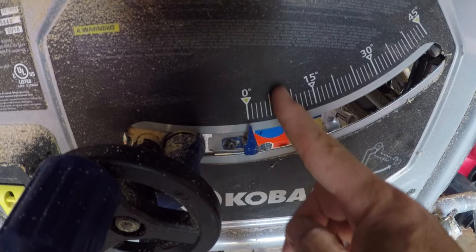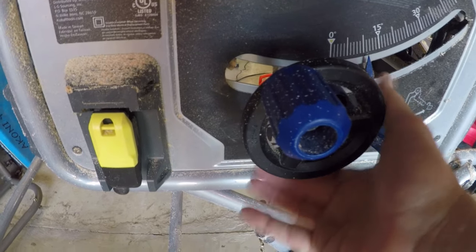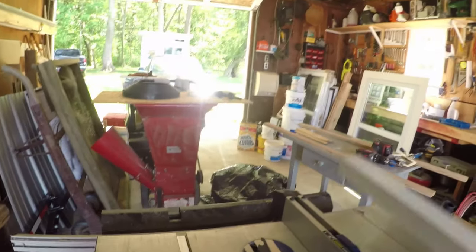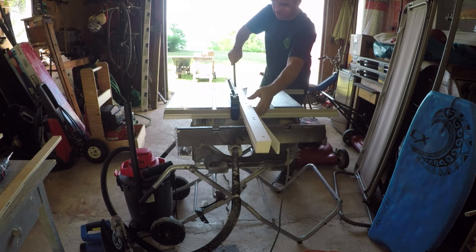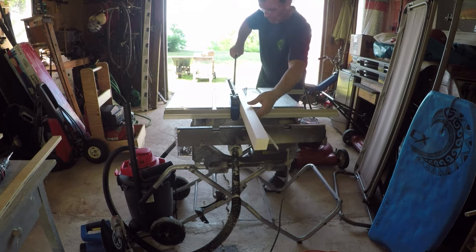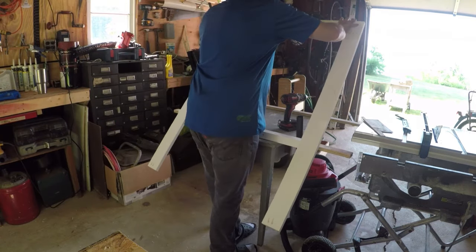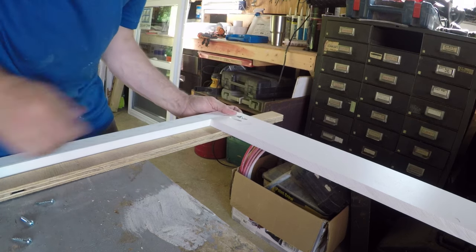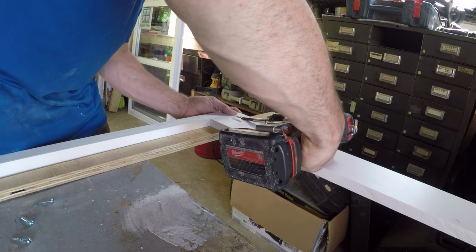Here's my glued-up piece — about a one-by-two, two-and-a-half inches in this case. I'm going to set the saw to 10 degrees to match the bevel on the end of the one-by-four, then make the cut. I do the face side first so I have it oriented right, and then the back side. I do sand it after the fact — this PVC really sands up well, giving a really smooth finish with about 180-grit sandpaper.